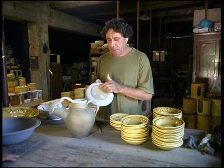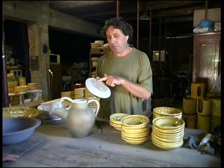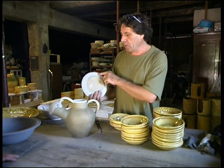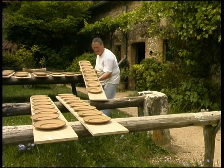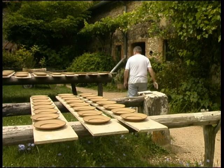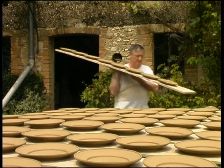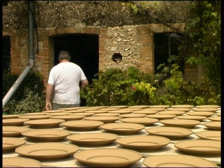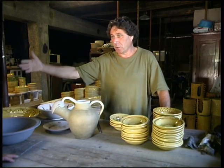Here is another piece that has been turned. It is Kluska clay. It has been turned and the profile on the exterior has also been formed. It has been glazed with a white glaze and then it has been decorated. The most delicate part is the drying between the turning and the baking, because it has to receive all the other various stages. It is the part of the work that looks trivial, but actually it is the most important part between the moment the piece leaves the wheel and it arrives completely dry at the furnace.